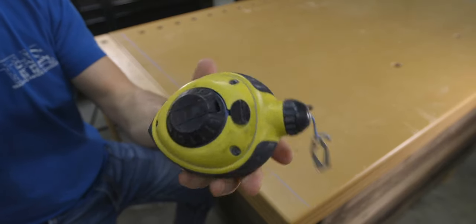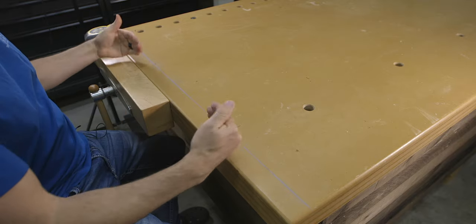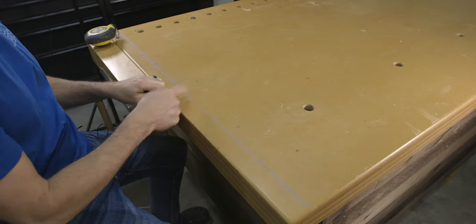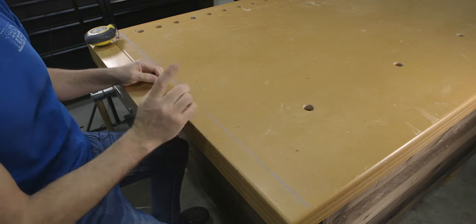Now that we cover the first method, let's talk about the second method, which is laying out 90 degree lines to each other. Some of the most common places for this to be used would be in floor layout, like tile, all aspects of home construction from rough to finish, and of course, some woodworking projects. To demonstrate this method, we're going to be using a chalk line. So let's pretend that the line on the bench represents the threshold of an opening, say into another room or space. Now, in order to get a square line that runs through that other room, we'll need to use the 3-4-5 method. And to do this is pretty simple because it's very similar to the first method.